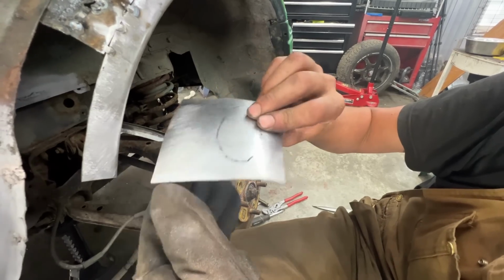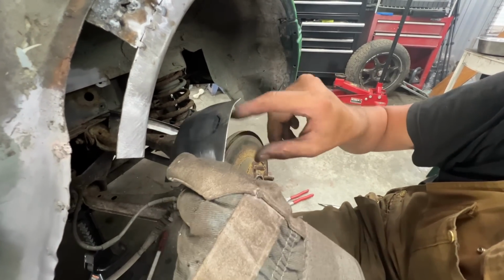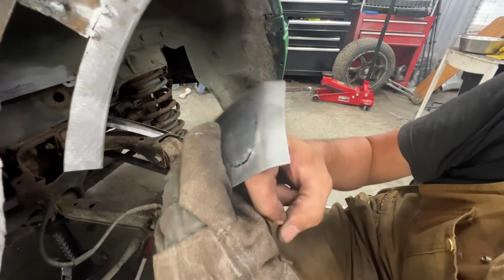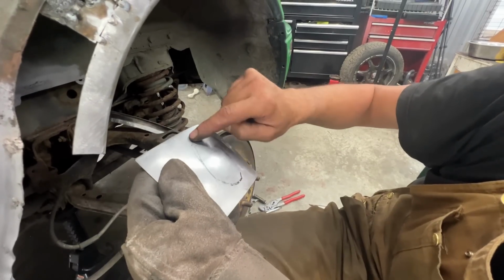So what I'm gonna do now is take another wheel with a much higher crown in the middle, and I'm gonna go in this direction. The wheel is gonna be like this, and it's gonna allow me to bend it more this way and still stretch here.